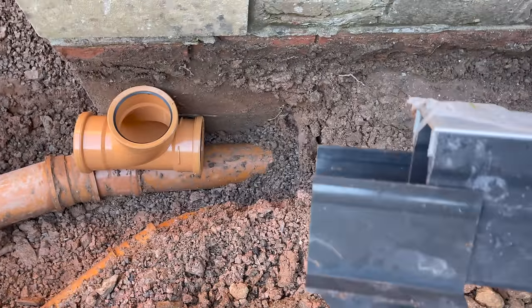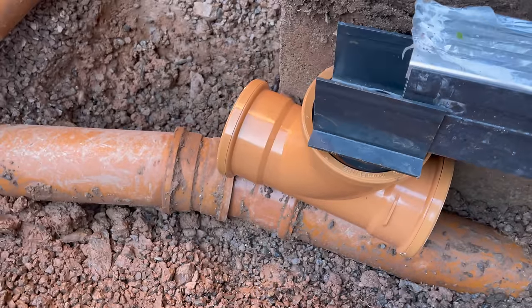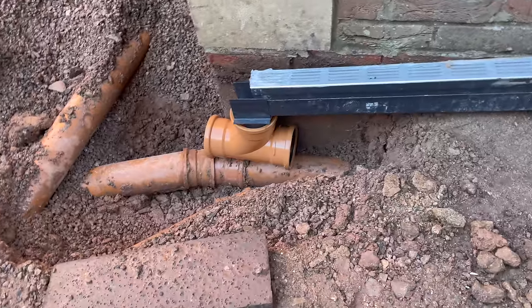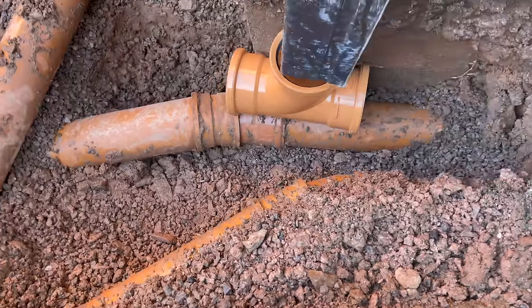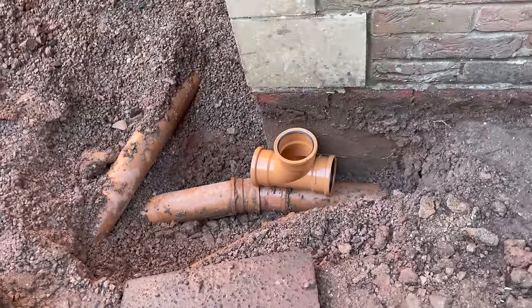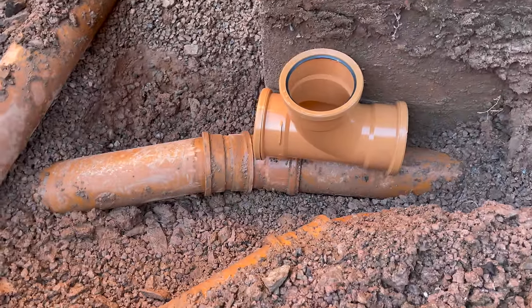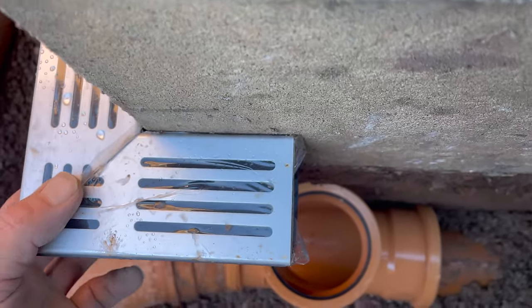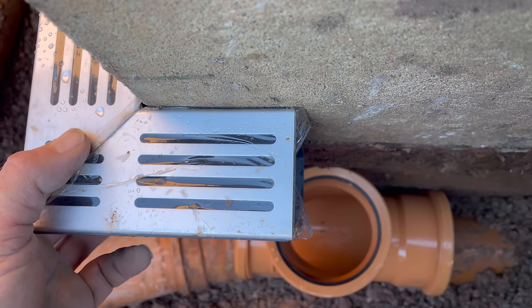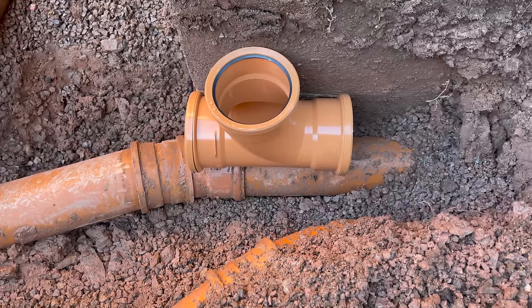As you can see, this is my drain here — basically that hole is gonna be right by there, so any water will drop straight through the pipe. But first of all I have to chop some of this out so I can get that in there, then cover it up with 10 mil chippings. First of all I'm gonna drink my coffee. So this is where we're gonna start — we're gonna put the corner piece here, so I want from the edge of the corner piece for the hole in the new drainage system to slot down into the pipe underneath me. So this is going to be the first one; I need to take away and disassemble this lock first.